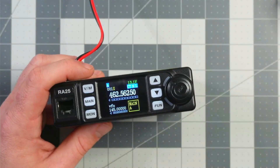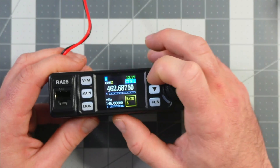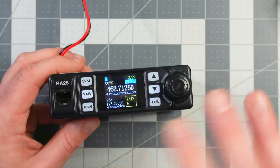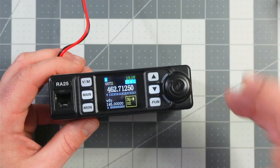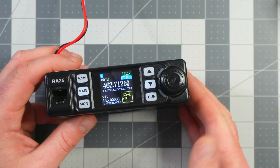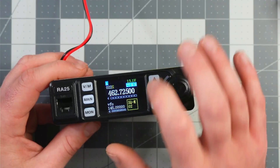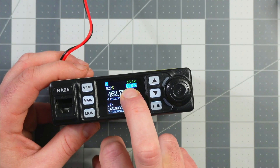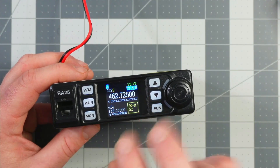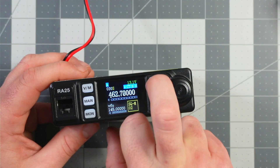Now I'm really excited to use the radio, but there lies another problem. Scrolling through channels — channel one, channel two — I want to make a note about channels eight through fourteen. Because this is a mobile radio, FCC rules state you can't transmit on channels eight through fourteen with a mobile radio, even at half a watt, so we skip all the way to channel fifteen. You'll also notice we have CT for CTCSS tones enabled, N for narrow band, and high power. And when we see a plus, that's a plus offset for repeaters as we enter the repeater range.